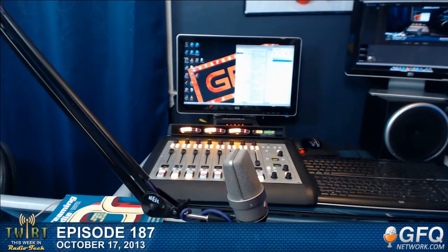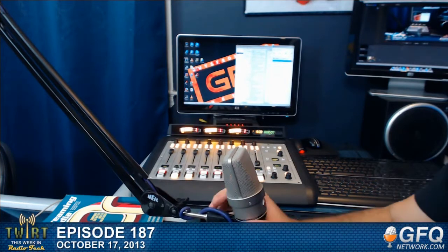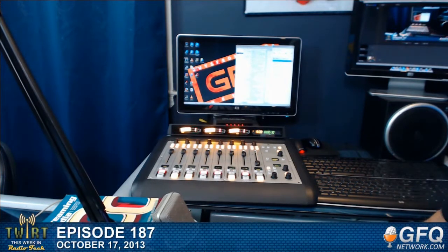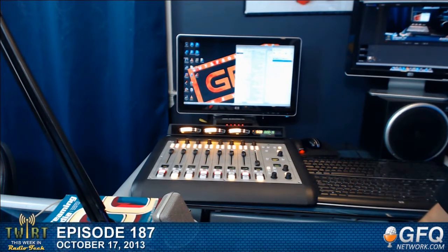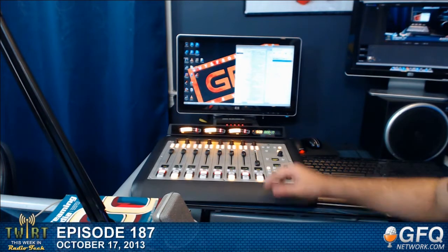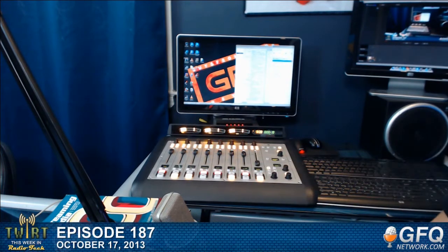So many possibilities. The meters on that thing are gorgeous. You can see how bright they are. They're these bright LED meters. There's a clock and a timer built on the console. And by the way, all the faders and the volume controls for the headphones and speakers, those are either optical in the case of the rotary ones, or on the up and down linear faders, no audio actually goes through those. They actually just create a digital signal that controls the DSP circuitry back in the engine. So you don't have any crackling. You don't have noise on the faders. You never have to clean a fader.